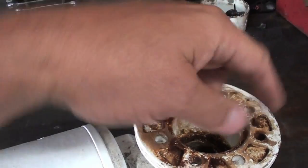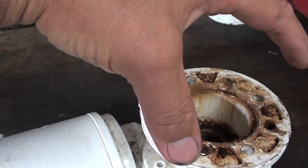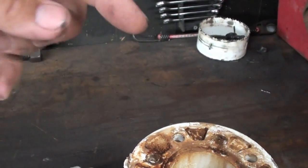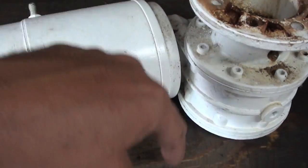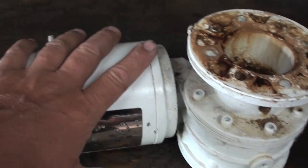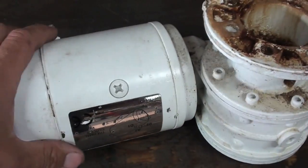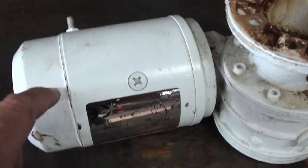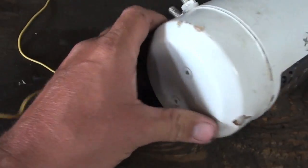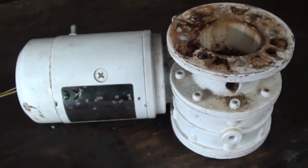You know, you got the shaft that comes up through here. This is the deck of the boat, and on top of here is your spool with your chain and line and all that stuff, and then it comes down in between here and goes in a pile in the anchor locker. And I'm sure this thing gets wet, so if this seal in here is bad, you're gonna get water in there and you're gonna get corrosion and junk. So first thing I'm gonna do is just clean this up a little bit, and then we'll go ahead and take the back off here and see what we got going inside.